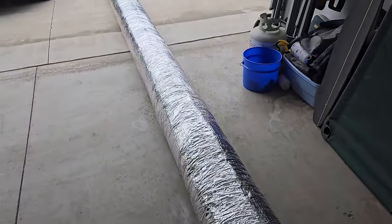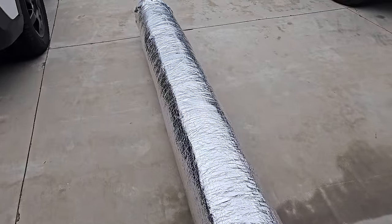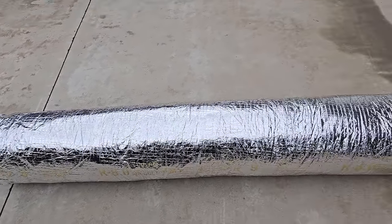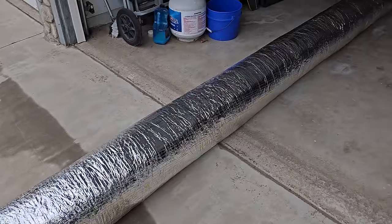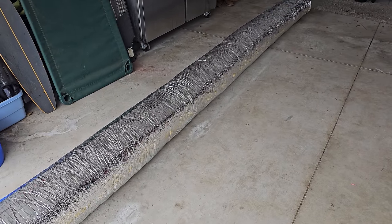We just stretched this duct out. This is a 9-inch duct. And the whole idea is that we're grabbing the inner liner. It's not so much the outer jacket. It's the inner liner and we're pulling the memory out of the little piece of metal that's wound in there. You know, we're gonna bend it and flex it to get it up into the attic, but it's just that we're trying to get the memory out of it.